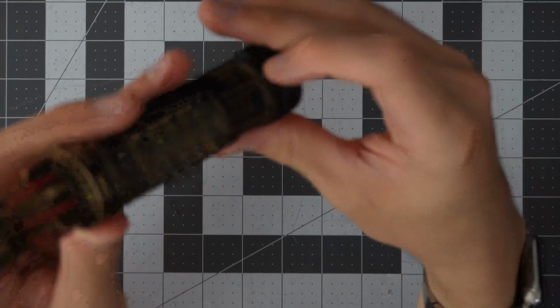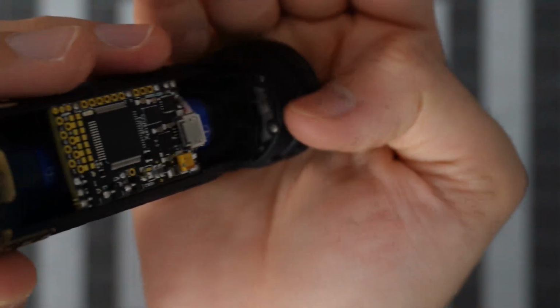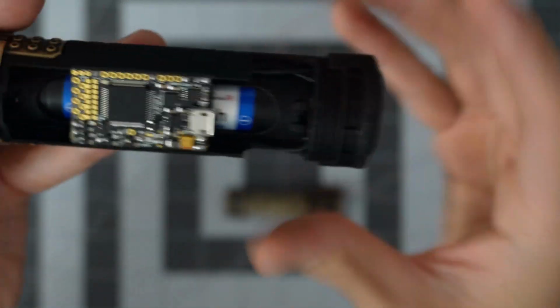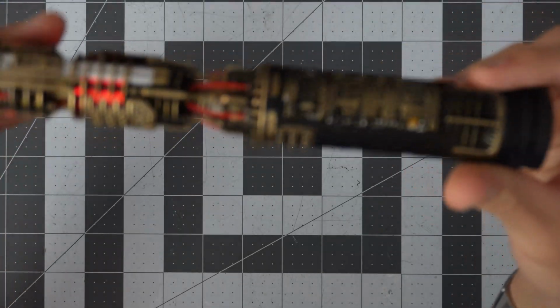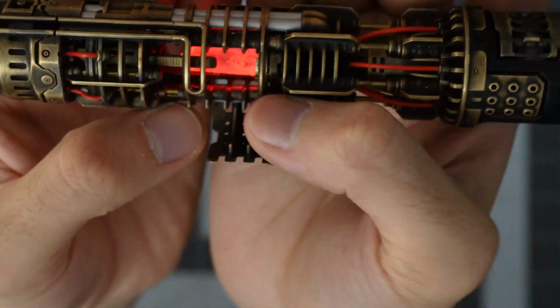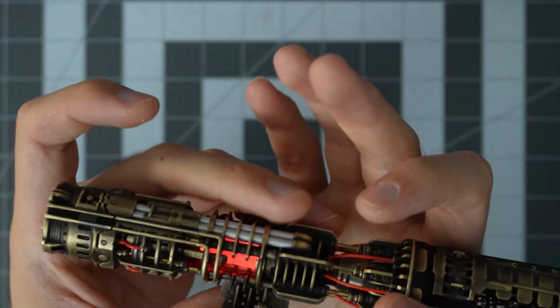Then I have a 3 pixel strip down here on top of the speaker, or right below the speaker. It's also covered in clear heat shrink and sanded for diffusion. It's a whole lot of pixels, and I think it came out really well. I also replaced the plastic crystal with a quartz crystal that I had. I chose out of a few of them that work, which was pretty cool.